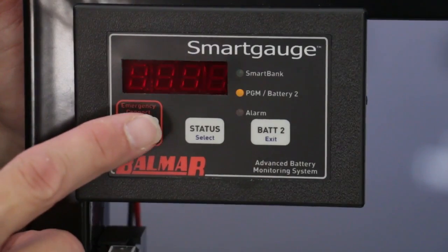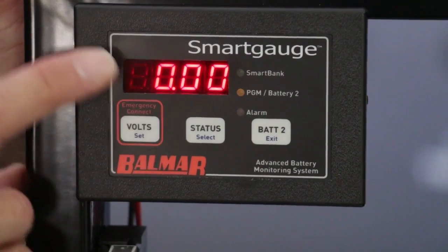So part of your charging system can also be properly monitoring your battery so you know what its state of charge is in an accurate fashion. It's very important, as you know, to recognize that once your battery gets below a 50% state of charge, you can be damaging the battery and shortening its life by 50% or greater. So once you've made an investment in an expensive and technologically advanced battery bank, it's very important to monitor its status.